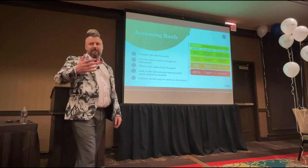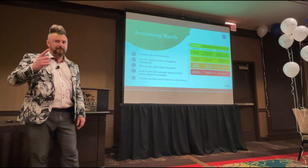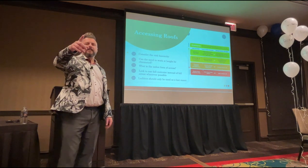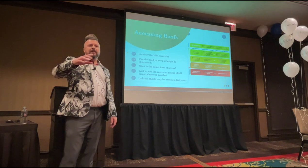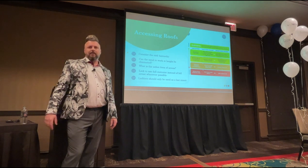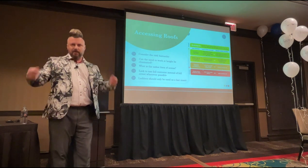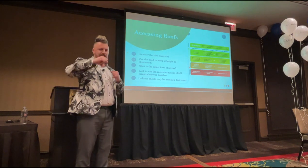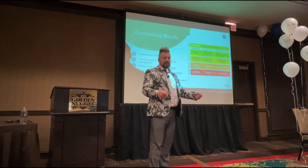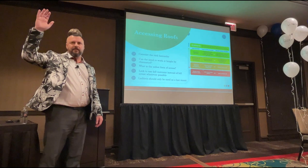So how about scaffolding? Is scaffolding an option? Might be. Who had 56 panels on their roof? Was that you? 54, 56 panels? Window Bright? Yeah, 56 panels. So that's like, let's say, an hour and a half, 2 hours work. So if all those panels can be reached on a single story slope roof, it's worth putting scaffolding up at that stage, isn't it? Put the scaffolding up, go up your scaffolding, clean some, move your scaffolding along because it's on wheels. That's a much safer process than going up and walking along on the roof.